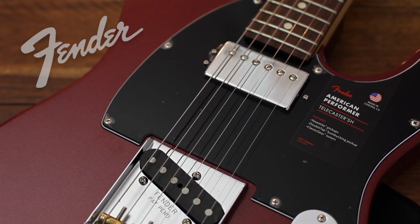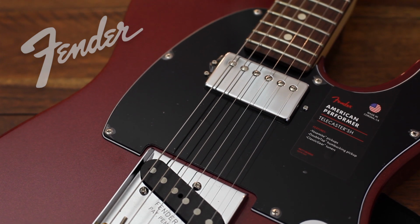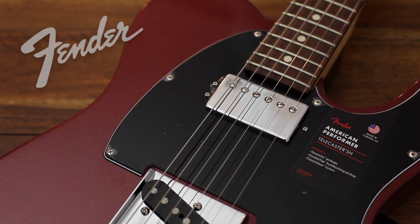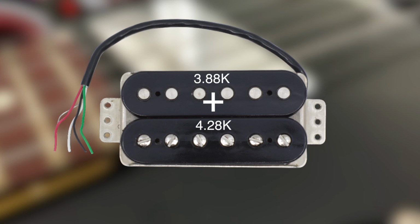The double tap humbucker pickup also allows some interesting optional wiring. Just for laughs, you could wire it with both full coils for a hotter 8.14K DC resistance, or use any part of the partial winding to get some interesting combinations.